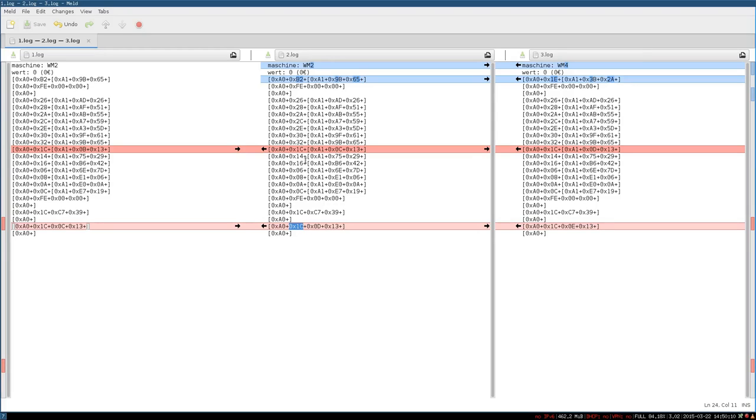Since it's that simple, I've already figured out that because it doesn't use any encryption, and because it does all the transaction again, this is probably not a very complicated smart card. There is no smartness inside. It is just plain memory. And I²C is quite often used for just reading and writing EEPROM values, small EEPROMs.